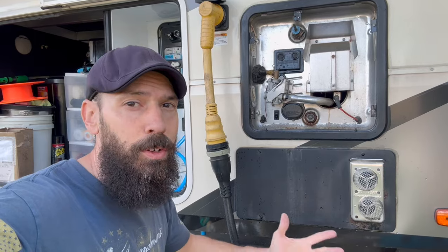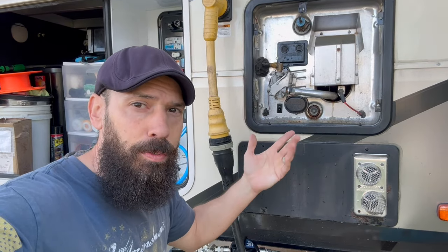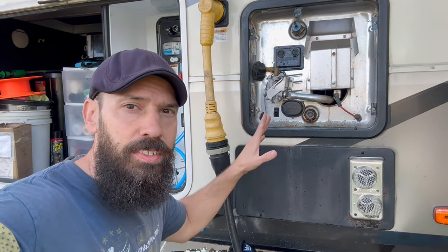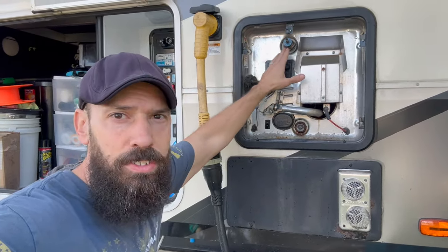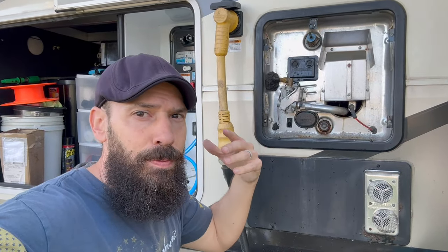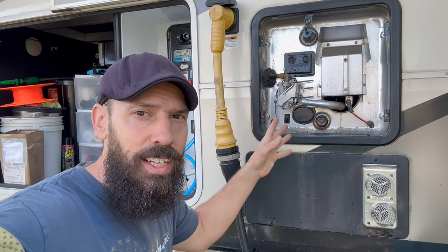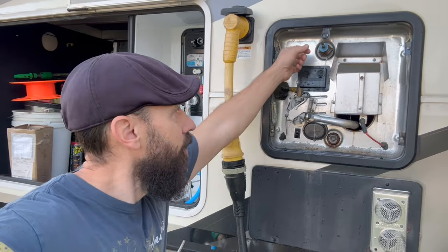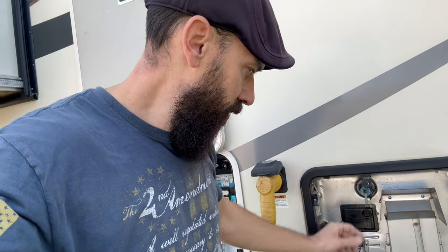Was that the fix? Well, we don't know exactly just yet, but we're pretty much 99% sure it was. We won't know until we turn the water faucets on and see if we get water coming out of the hot water side. Right now we are filling this tank back up — we have the new anode rod in and we still have this open. We'll know when the tank is full when water starts coming out of here, and then we'll close that. We can see that the tank is full, so we'll go ahead and close this. Now we're going to go inside and turn some water on and see what happens.